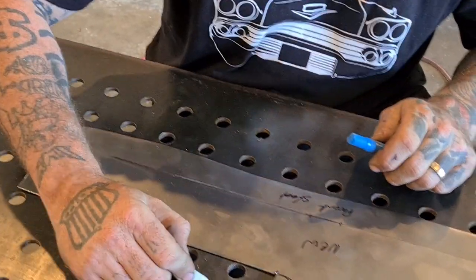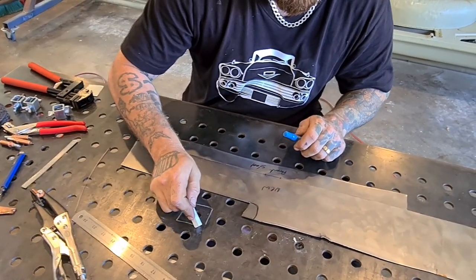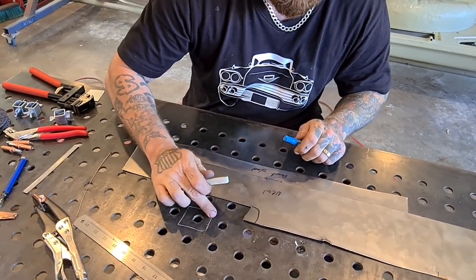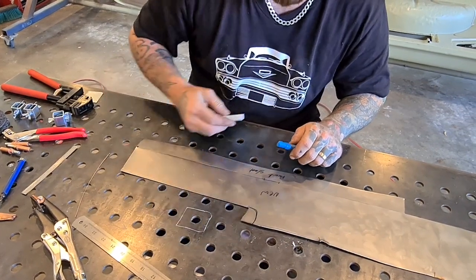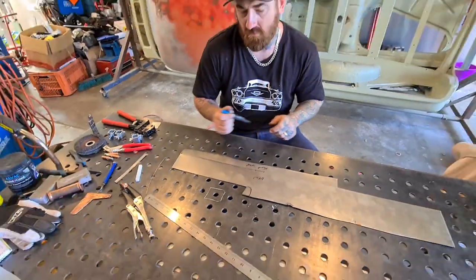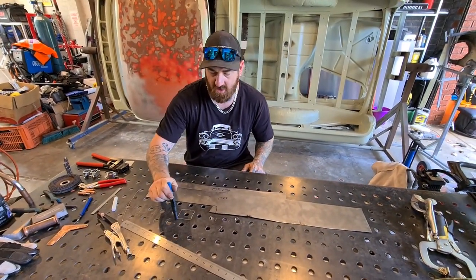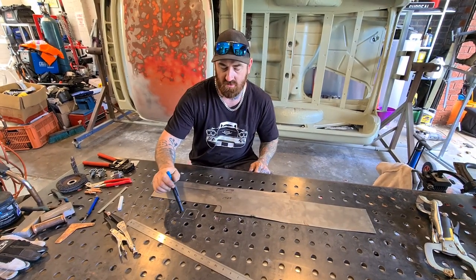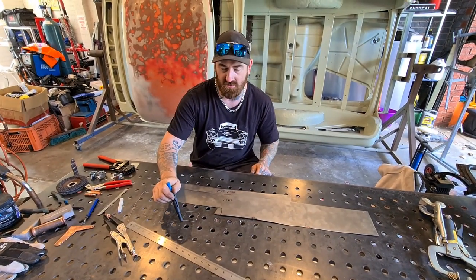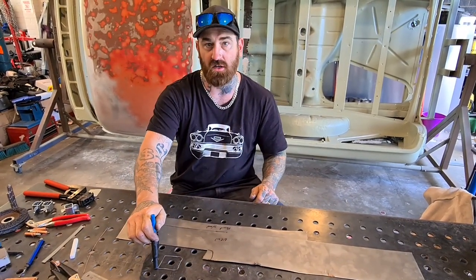When you're doing it on a square hole, round it — don't have any actual corners if you can help it. If you do have corners and can't help it, start right on the corner to begin with. Don't heat the panel up and then try to get to it, because the more you work it and the closer you get to that corner, the more chance it's going to blow out.